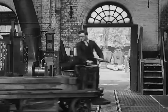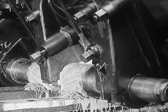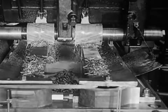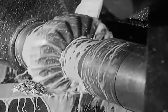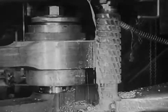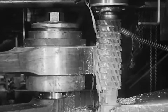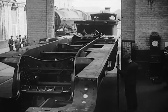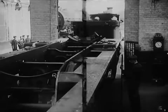Machining the flats is a first operation in the machine shop — a process that gives a glass-like surface to our rods. To reduce the weight of the rod, the sides are fluted, and this is the machine that does the job. Circling the ends, as it is officially called, seems to provide a fitting description of this operation. Holes have to be bored at either end of the rod to take the bushes.